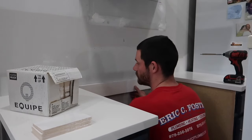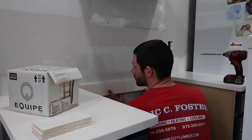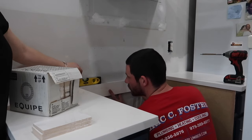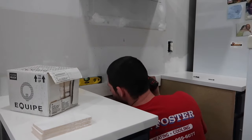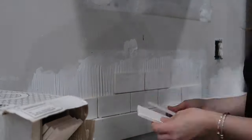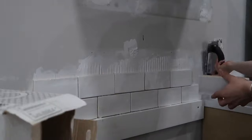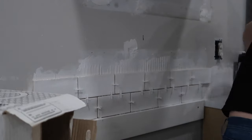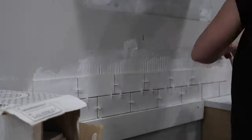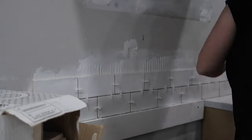For the area behind the stove I had my brother screw a piece of wood between the two base cabinets. This provided a level edge for the tiles to sit on while the adhesive dries and it prevents any possibility of sagging. Once the board was secure I began tiling, lining my first tile up with the center of the wall and working outwards in sections again.